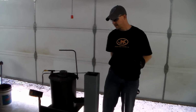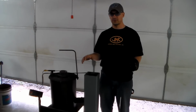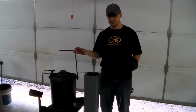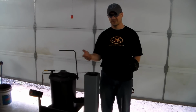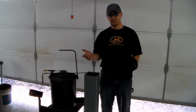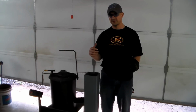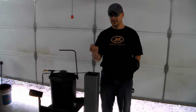I wanted to mention that somehow it got edited out of the first part. It is absolutely critical that you do not introduce any moisture into the molten salt. Anybody who's ever worked around molten lead, pouring sinkers, jigs, bullets, can tell you, with lead you're working around about a 400-degree range when it's in its molten state. And that's still plenty high enough above the evaporation point of water that if you introduce any kind of moisture into molten lead, that moisture will immediately evaporate,